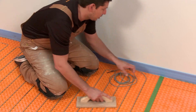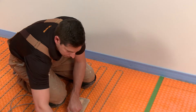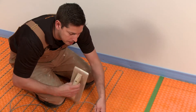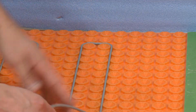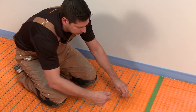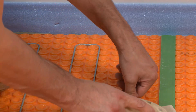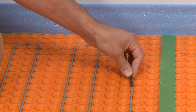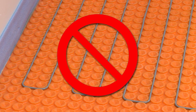In the case where there is excess heating cable and no space left in the buffer zone, the cable may be removed and reinstalled at an alternating 3-stud, 2-stud, 3-stud spacing. This can be done in the buffer zone or in localized areas where extra heat output may be desirable, such as in front of vanities or bathtubs. The heating cable shall not be installed at a 2-stud spacing in succession or at a 1-stud spacing.